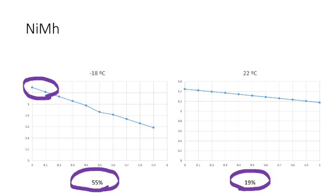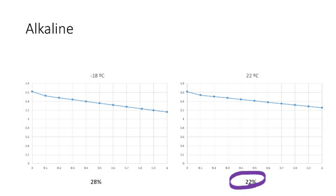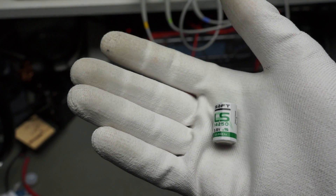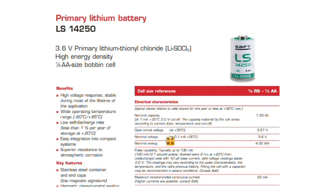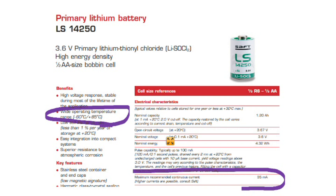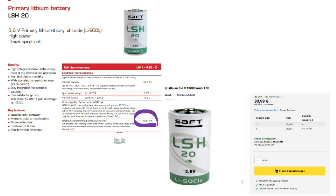Now we go on with non-rechargeable batteries. The first is an AA alkaline battery. This type is not well suited for high currents, but it does not care too much about temperature. You can use these batteries without problems, also in cold weather. As the last contender, I have a very special battery which is made for extremely low and high temperatures. It should work from minus 60 to plus 85 degrees centigrade, but it can only supply a minimal amount of current: 35mA. It is definitely not made for high currents. The datasheet says that already at 35mA, its voltage falls below 3V. If you want to use this technology for your devices, you definitely need bigger batteries, but they are quite expensive.